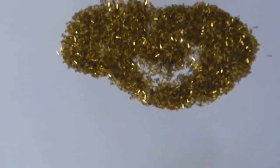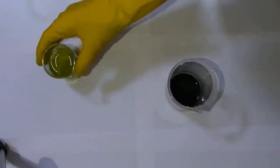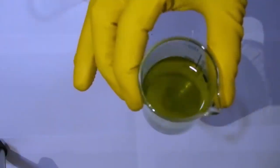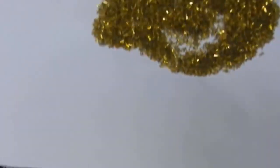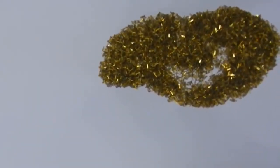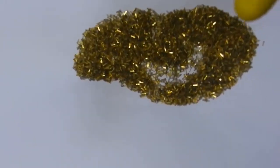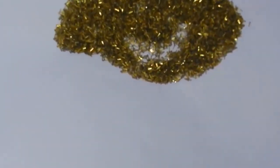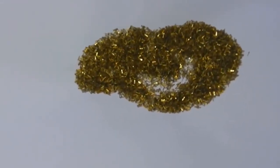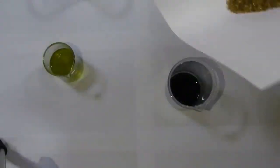Now it remains for us to wash off this gold from the contacts. To do this, I will use an alkaline reagent, the recipe that I gave on the channel, to wash the gold from here the fastest way. I also have a video on my channel, here I give a link to processing by the classical method. Here is the link from above, in the right corner: processing of similar contacts by the classical method, that is, by etching the base, which is a longer process.